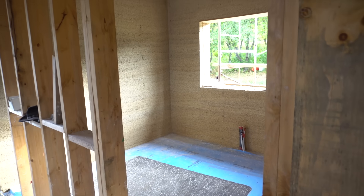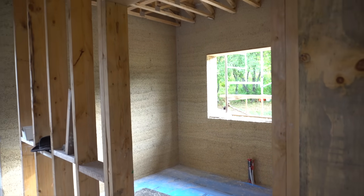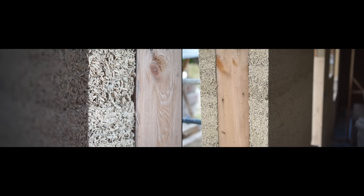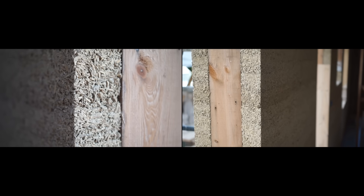It's also a good option because it's a regulator wall. It regulates the temperature and regulates the humidity, because it's very thick and porous — it can take in humidity and release it. The R-value of hempcrete is R2 per inch, R2.1 in fact. So we build walls that are 12 inches thick, which gives R25.